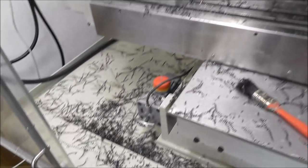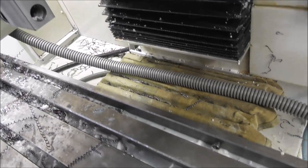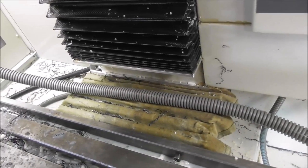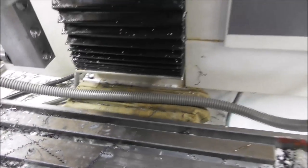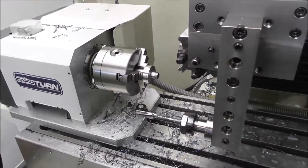I've got to keep a little bit of an eye on the swarf build-up so that I don't get too tangled up, especially with all this wide travel between the gang tooling positions. I put an old piece of conduit over the sensor cable because it's a pretty light cable and I'm getting blue hot chips flying in all directions. This is just a temporary fix just so I can get the production out.